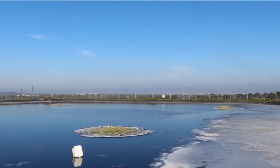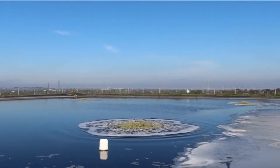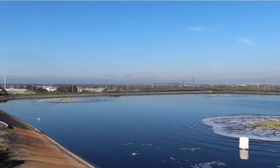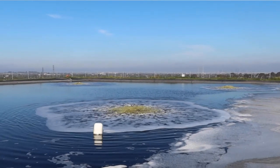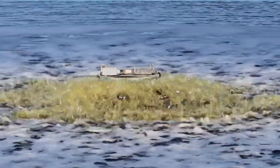The Aquarian Commercial was originally designed for high load wastewater ponds, but it's also commonly used in irrigation ponds that also need aeration, especially without spray drift. This unit doesn't create spray drift, so if you're using reclaimed water in an irrigation pond situation and you don't want the risk of potentially pathogenic water spraying out on your golf course, for example, they're a great use for that as well.